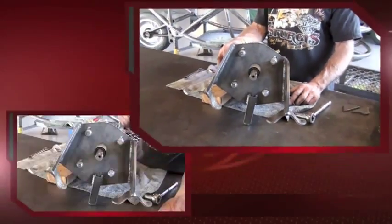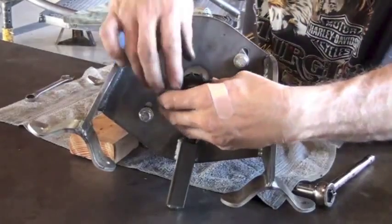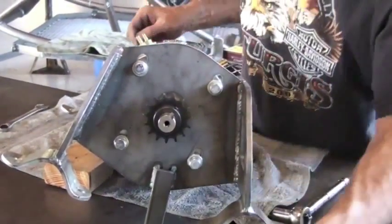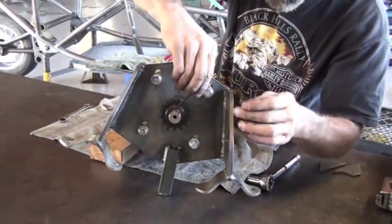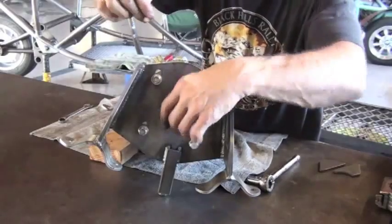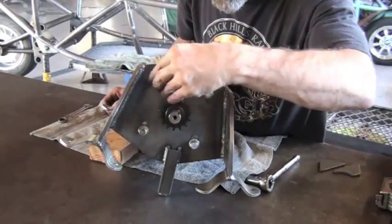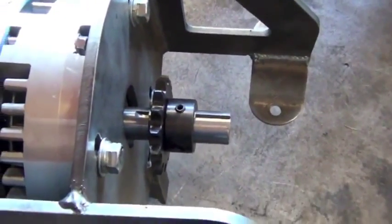We need the motor sub-assembly in this position in order to put the sprocket on the shaft of the motor. We're going to install the sprocket with the shaft side facing outwards, and the motor sprocket goes over the shaft with the key in place — it's easier to do it that way. Then we're going to adjust the set screws and tighten them down so that the shaft and the sprocket are connected together. The extension on the sprocket is facing outwards towards the end of the motor shaft.